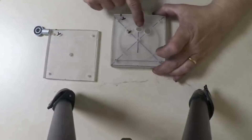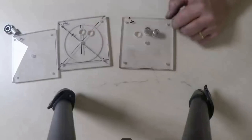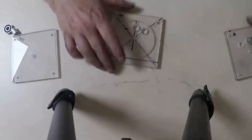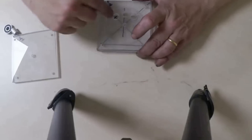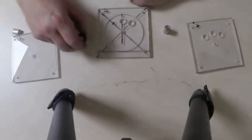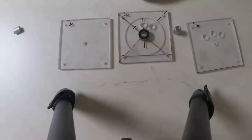So we took that one away and drilled those through and marked that one, took that away and drilled that through. So that's your front cover plate with its three port holes, and we're going to stick that 12mm pipe in there and that will make our ports. This plate - you can see where we scribed the circle - so we now need to drill out that entire circle. You'll notice that I only drilled through two port holes because they line up as the circle swings. This one actually is an exhaust and we'll trim that out at an arc, because it will exhaust around the circle and out the top. The other thing we need is a bearing - this is a skater bearing, it's eight millimetres thick. The acrylic is nine millimetres and the skater bearing will go in the centre. This is the rear plate and the rear plate is all finished.